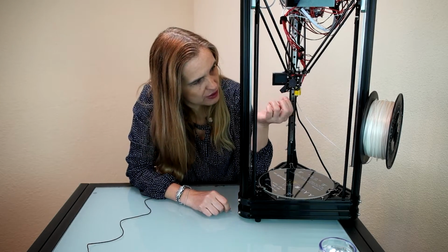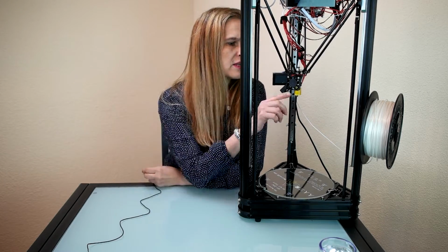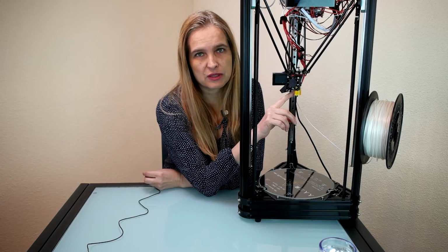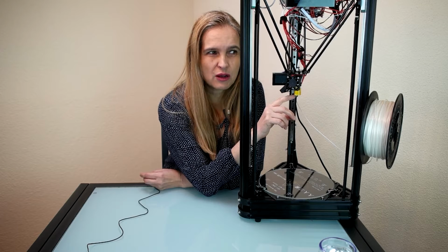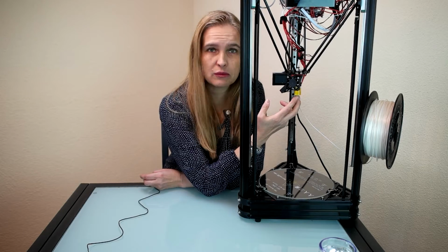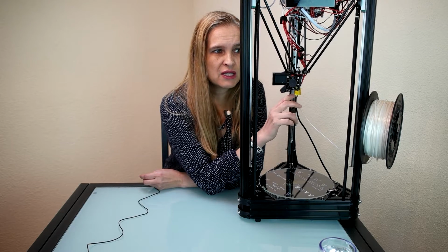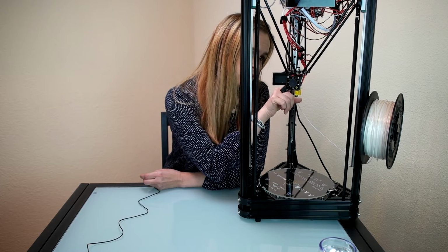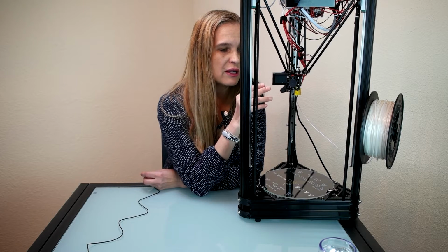When I set it up, I had a problem with the heat cartridge here. It was malfunctioning, and so I had three nozzle jams, and as I was a total newbie, I didn't understand what was going on. I didn't understand why the temperature was all of a sudden dropping. Depending on how the wires were bent, I had heat or not. So it took a while until I found it out.